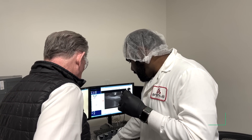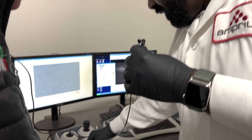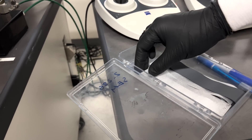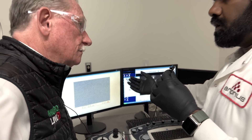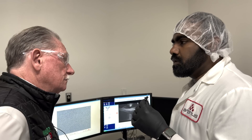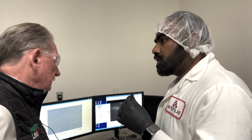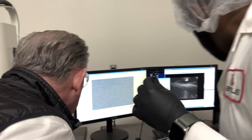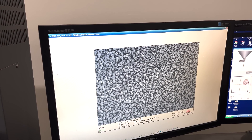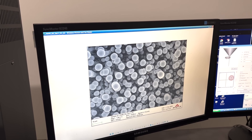We get coupons from the roll from the anode team — basically sampling them. I have a start and an end coupon that's labeled. We take a top-down view and a cross-section view to see how it looks under the microscope. That gives us a good idea of how the process has turned out. We're looking at density and also the nanowire diameters. This is like a 100X view, and this one is 250X, so you can get a good idea of how dense the nanowires are grown and the uniformity.